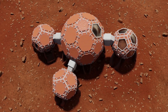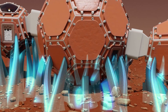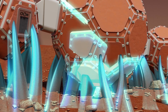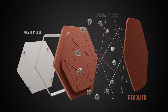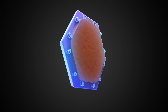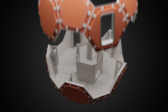The fabrication process begins with the external support structures created by adding successive layers of laser melted basalt fiber in a fused deposition. Next, the lower panels of the habitat exterior are placed on the external supports. These panels are made from regolith and polyethylene and are reinforced with impact resistant fibers. The properties of these materials provide effective pressure retention and protection from impacts and radiation. This technique allows multiple configurations of panels to be manufactured with the same process and equipment.